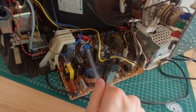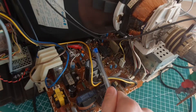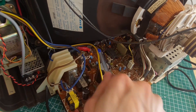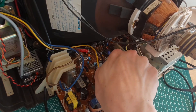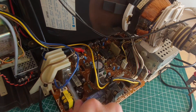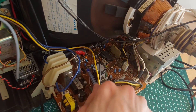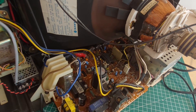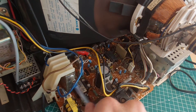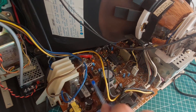The analog video composite signal goes through this coaxial cable directly to the main board of the TV, and it is injected right before the PAL and Chroma decoding chip, after the section which is no longer used — which was the original RF aerial tuner, the analog tuner of the television set.